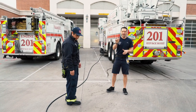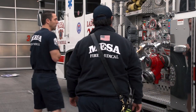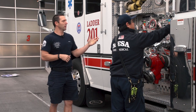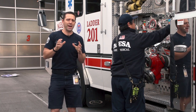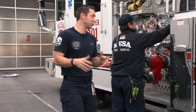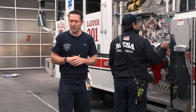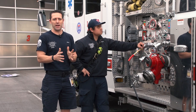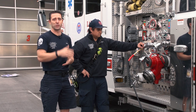We're in pump gear and Logan's going to throttle up to 180 PSI, with a plus or minus 10 PSI range. Each truck is going to be different, so we just want to make sure we're right around 180 PSI. You'll easily be able to identify an effective spray at the nozzle end, and we're going to show you what that looks like right now.